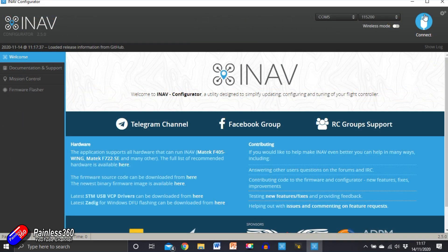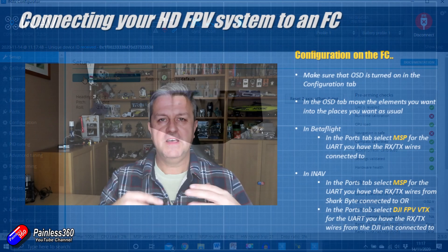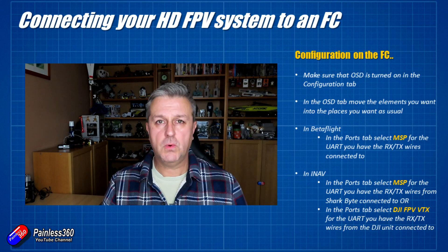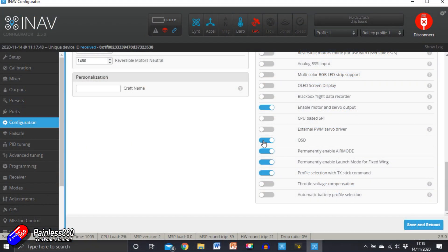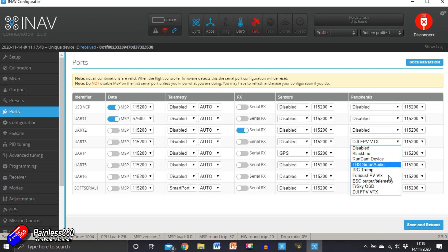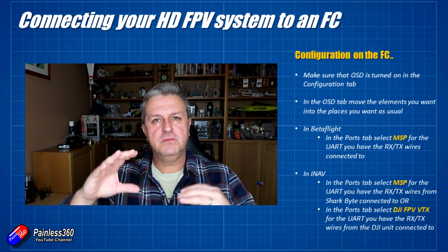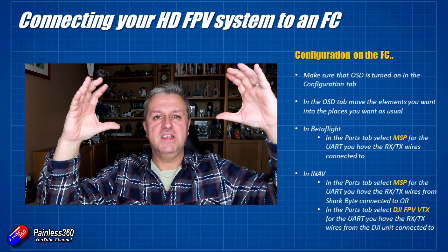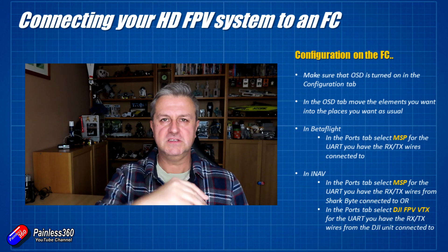If you're talking about iNav, then it's a little bit more complicated, because iNav has much more stuff that it supports. Things like DJI don't support all the extra on-screen pieces of information that iNav supports. So iNav created two settings for this — one being the MSP setting, which is the standard Multi Wii Serial Protocol that iNav uses, a superset of what's in Betaflight due to all the navigation features iNav supports that Betaflight can't do. But if you're plugging in something like a DJI unit, then rather than select MSP, you're better off selecting DJI FPV VTX on the port that you have selected. What that does is send the more basic Betaflight-style MSP to the goggles that they'll understand, rather than the superset which will just confuse the DJI system — though caveat, this may get fixed in future.